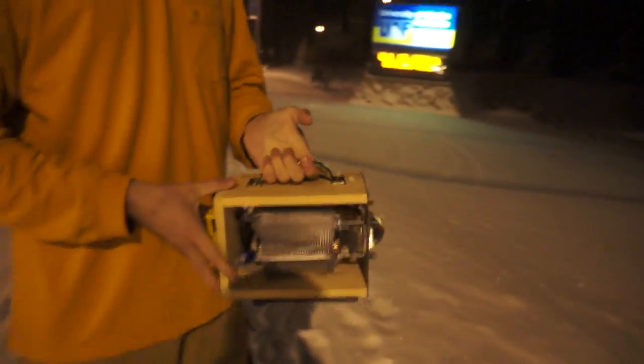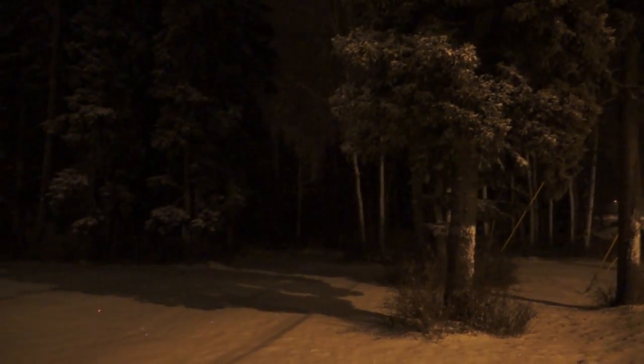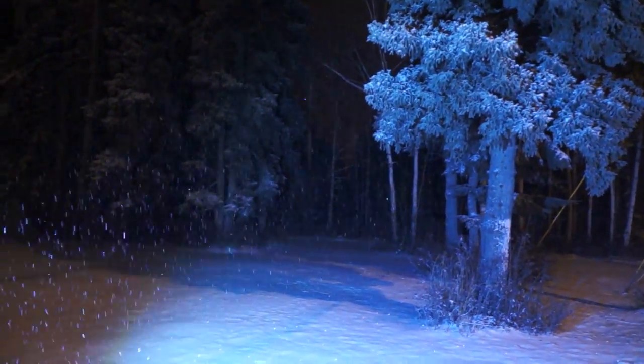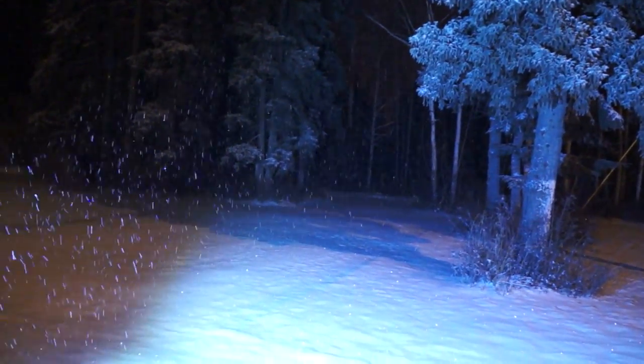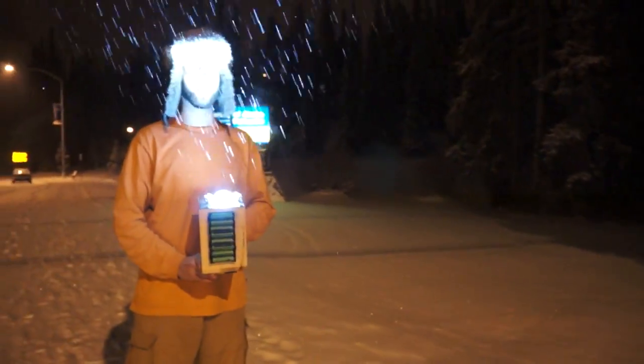The idea is while the light is warming up, it's giving more and more power and increasing the PWM more and more, until the current sense resistor says that's the right amount of power and it stops. And that prevents me from damaging the LED element. So this is my 100 watt LED flashlight.